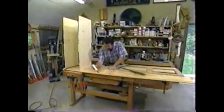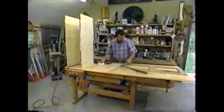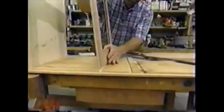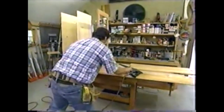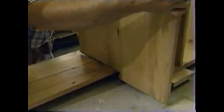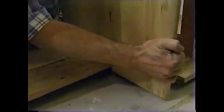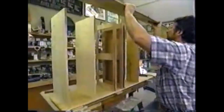The shelves and dust frames are installed in the dados first by applying glue along the edge of the dado, setting them in place, and toe-nailing some brads through the frame and into the cabinet. Before I put the countertop on, I'm taking the time to put the bottom of the upper cabinet in place. I've lifted the side above the workbench so I can slip the piece in and slide it to the back. A little glue in all the dados for the opposite side and we'll set it in place, line it up, and nail it. The top piece sits in the rabbets and is secured with brads.